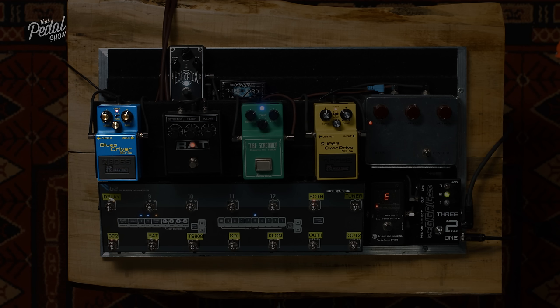within that, you can take your EQ stage and put one EQ before the gain stage, or after the gain stage. You can have signals going around the gain stage and mixing back in. The Klon's a really good example. We have the input stage, so we've got the buffer on the input. Then we have our clipping section of the Klon, which is a hard clipping section. We've got our clipping diodes going after the amplification. But we have these two other paths around that circuit that mix in a bit of the original signal.